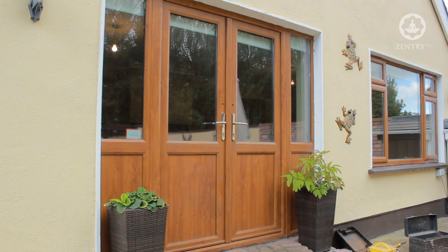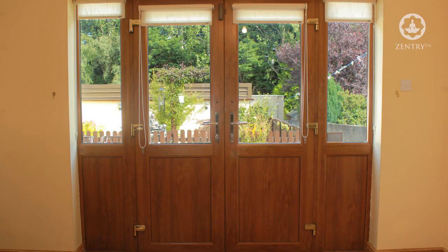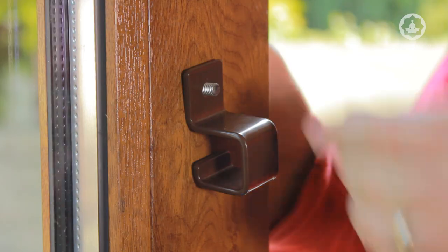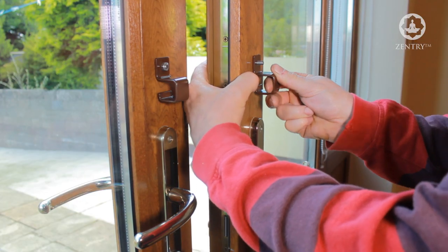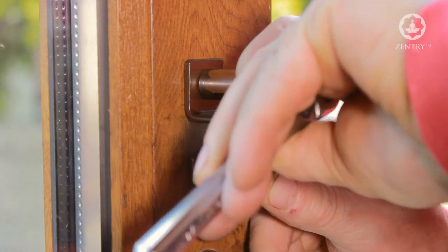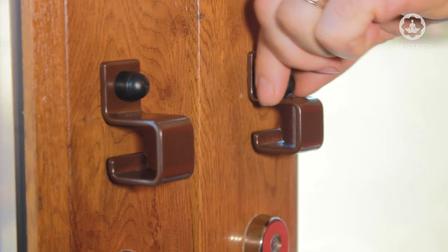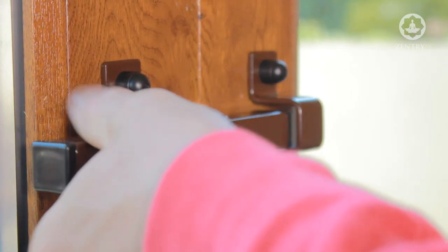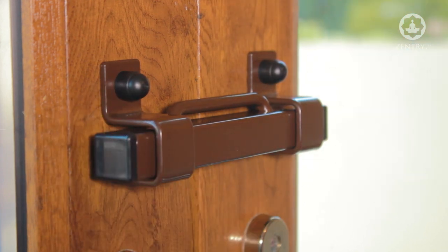From outside, insert the two carriage bolts through the two holes provided. On the inside of the door, insert the force bracket and semi-tighten the nut, then repeat the same process on the opposite side. Make sure both brackets are in line and tighten the nuts fully. Add the two nut caps. Slide the channel through both brackets and then place the safety U-pin into the two holes in the bar.